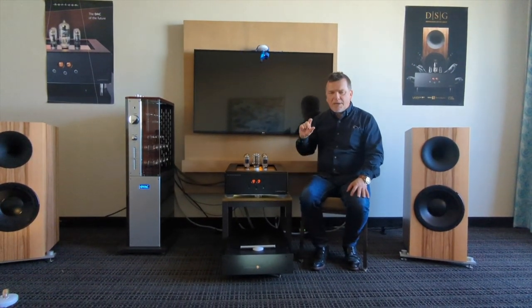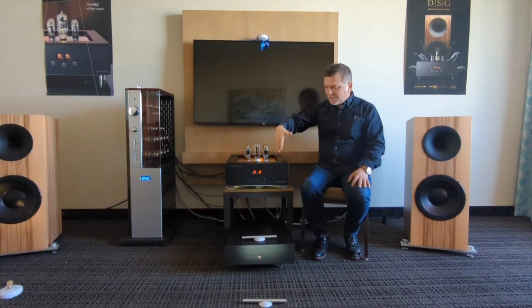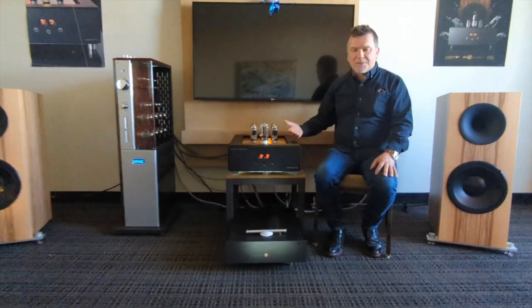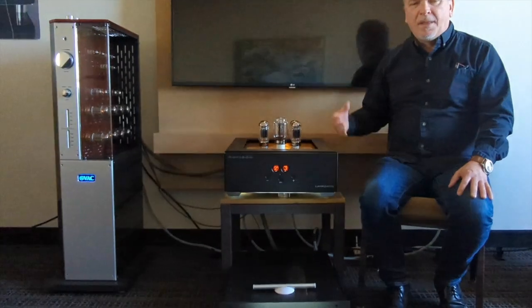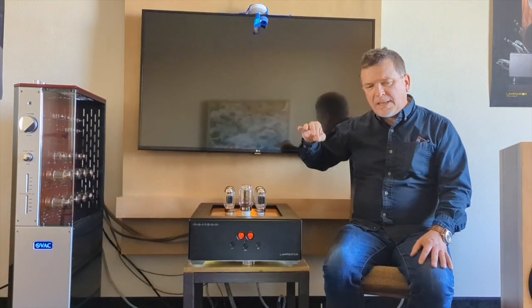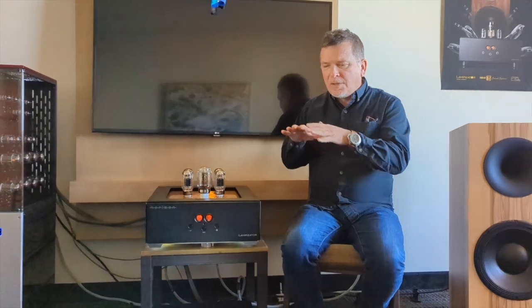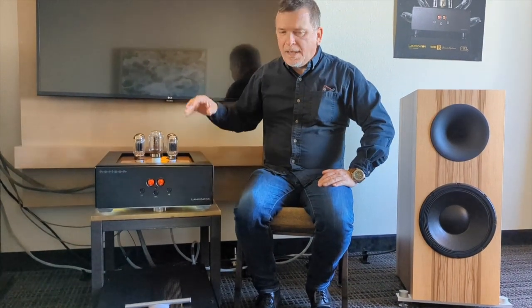So these slabs are 1 inch thick slabs of aluminum. There are 6 of them, so the front, the top, 2 sides, the back and the bottom. And perhaps the most important parts are the invisible ones, which is the bottom. What is new is that, unlike in our previous products, we don't place PCBs standing on these little stands, so that the PCB is not flexing from vibration or any force.